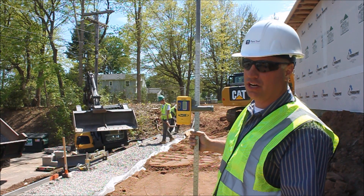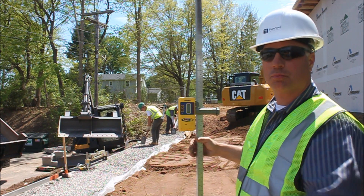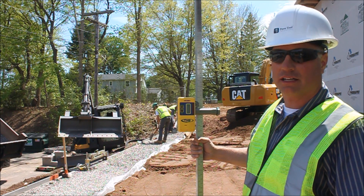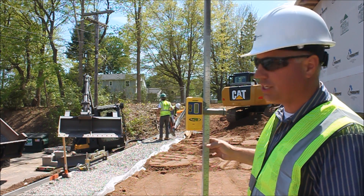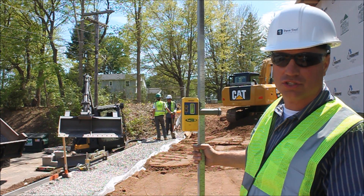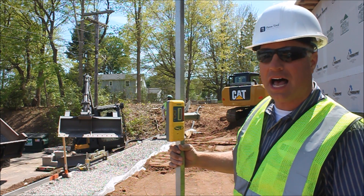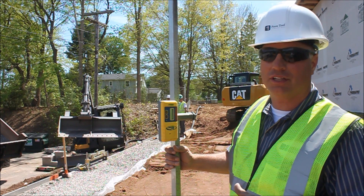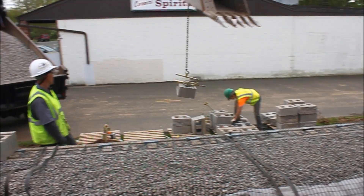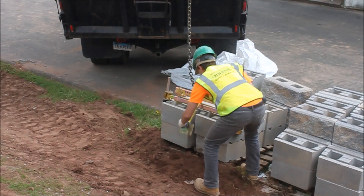We're getting into some unique positions here — obviously tracking back and forth a lot, with the parking lot down below and the neighbor's property, so we've got to be super careful. A lot of this product is going in and out with a lot of material, so proper machinery and proper equipment are essential. You've also got to make sure you're using the proper tools — it's a 104-pound retaining wall block, so it's key that we're using the proper equipment for lifting. We've got our single block clamp removing blocks onto our wall and onto our grid for our base course and on top of our grid layer.